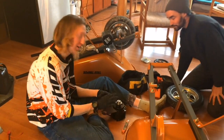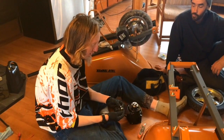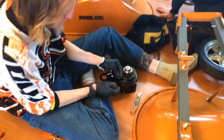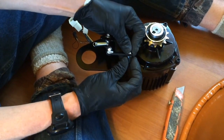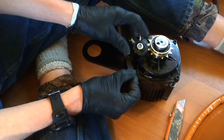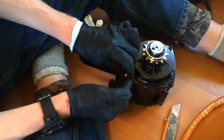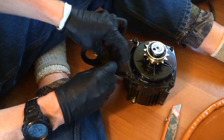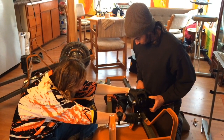The Cyclone isn't really a starter kit for people that haven't done this sort of stuff before — it's more advanced. A good example is the tensioning wheel needs to get mounted and there's really no proper place to mount it the way we're using it, so we have to drill a hole. We've marked a hole and want it far enough away from the body so the nut can connect to it. There are three different spacers in the kit and the chain wheel lines up just perfectly with one spacer. We're going to zip-tie the spring on eventually, but we want to mount the tensioner on here before mounting it on the wheelbarrow, because once it's on there we won't be able to get it on.